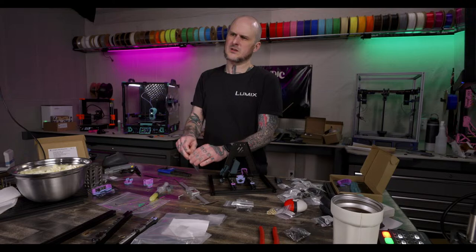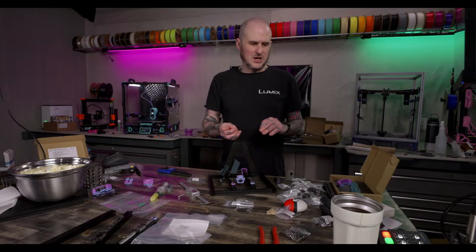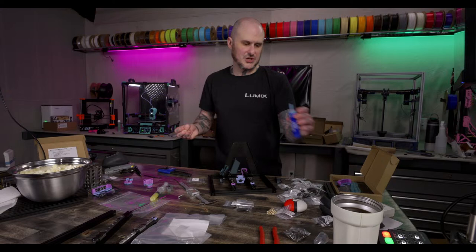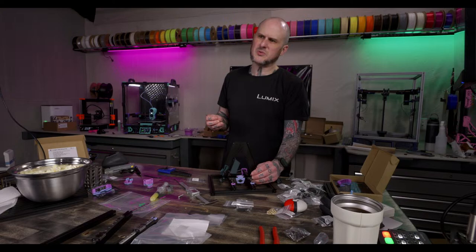Never had heat creep issues with 25x10 on Dragon hot ends, but can't say the same with a 4010 or 3010. Yeah, but I believe you. But there's also some awfully weak 4010s and 3010s out there. Like, I had a major heat creep issue with a 3010 on my V0.1 originally, because I just underspec'd the fan really bad. Only had heat creep issues with SB and printing PLA on Revo.